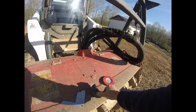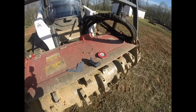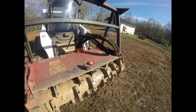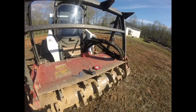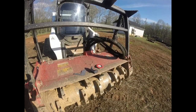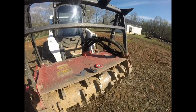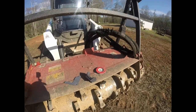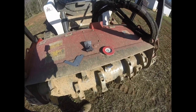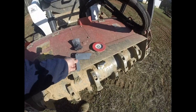These Viking blade teeth are $41 a piece. The carbides I run — which are double carbides for FECON — are about $100, though some places you can get them a little cheaper. I normally get somewhere between 300 and 400 hours on the carbides. I like the production from the blades — it's definitely good. I just don't know if I'm going to like the maintenance between jobs, between days.